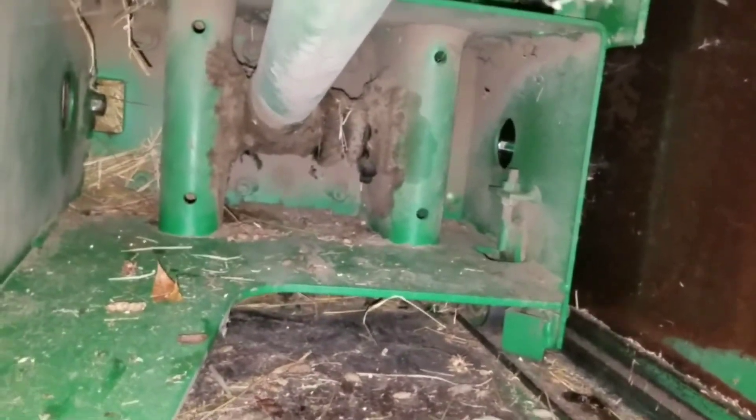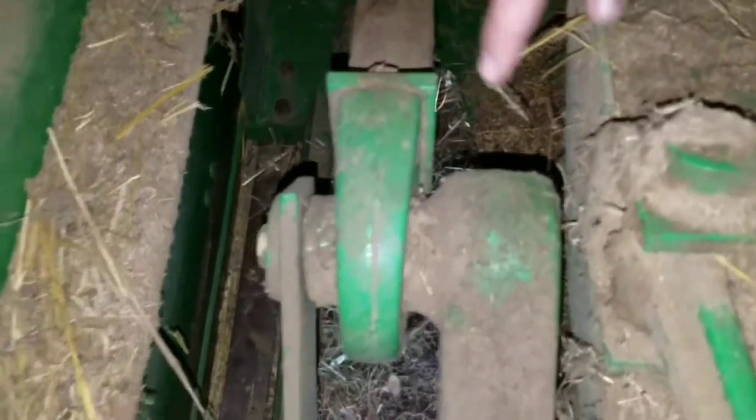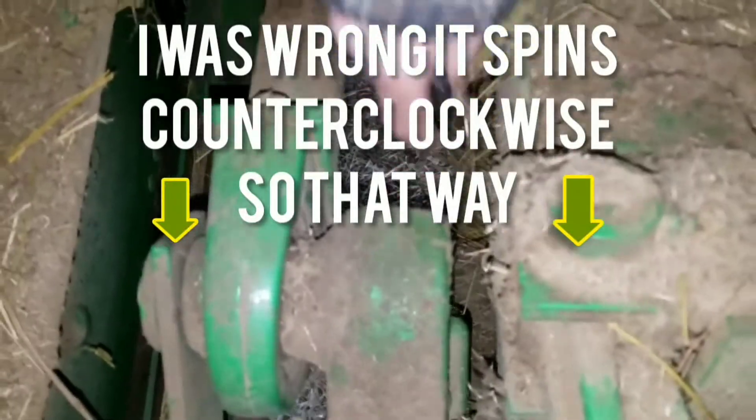There it is. There's a weight on the side here which keeps momentum going constantly. When this plunger goes, it takes so much force forming a square bale that the weight of this wheel right here keeps constant momentum — or inertia on it. It's timed perfectly: whenever it spins, this weight goes down and pulls the plunger back. Then the stuffer fork goes down and shoves more hay into the bale chamber. And as soon as the bale forks are out of the way, the plunger again will go. It's doing this multiple strokes a second.